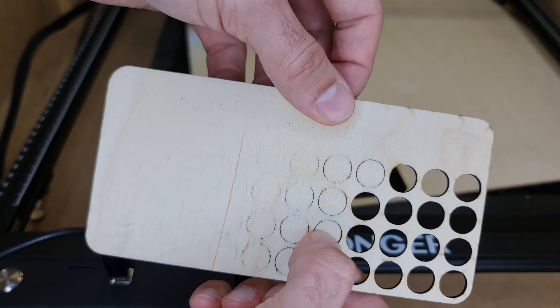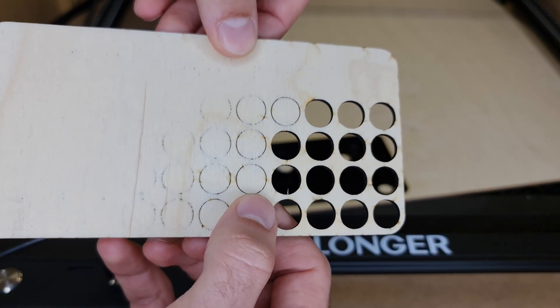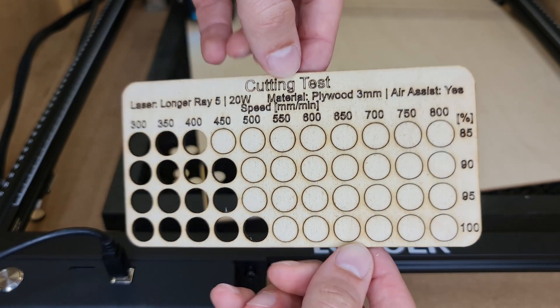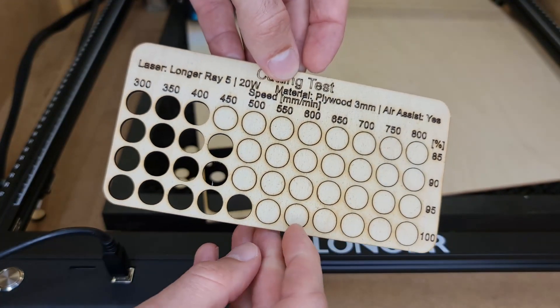The typical honeycomb is a great solution to the problem. However, if you have ever been cutting with it you will have noticed that the backside of your material shows smoked spots all along the cutting edges. This spot corresponds exactly to the contact point with the material. This is an undesired effect especially when you cut natural materials like plywood, wood, MDF and so on.